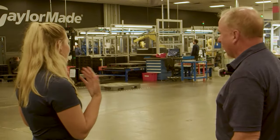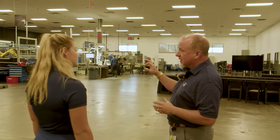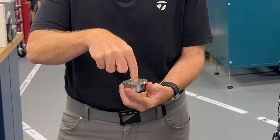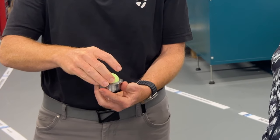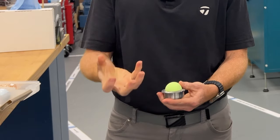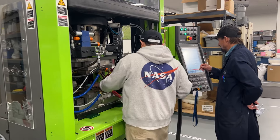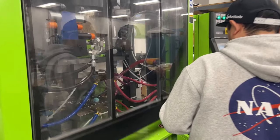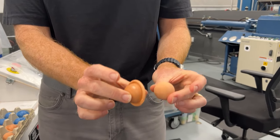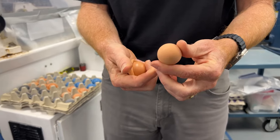Now we're at the covering stage. The core comes into the line and the dimpled cavities are like a muffin pan that's dimpled. A shot of urethane goes into each cavity — kind of like putting batter in a muffin pan. Then the mantle is pressed into a certain depth to make half a ball at a time: bottom half first, then the top half. The ball comes out looking like Saturn with a ring around it, and that ring is removed in the next operation to achieve the correct outer diameter of the golf ball.